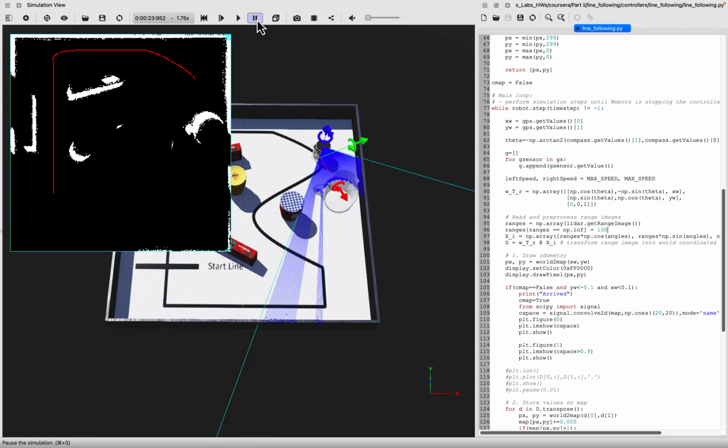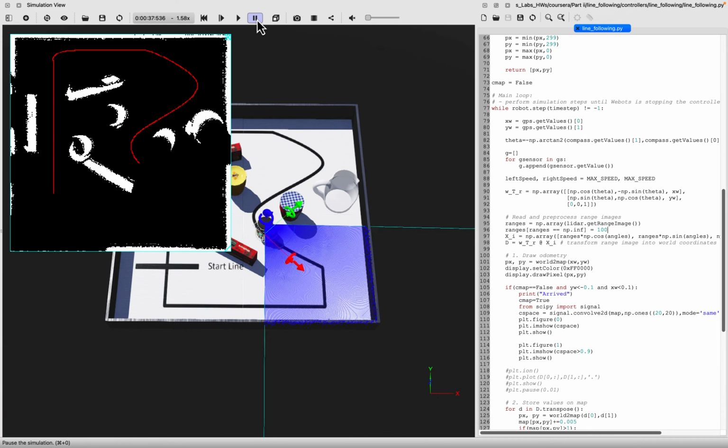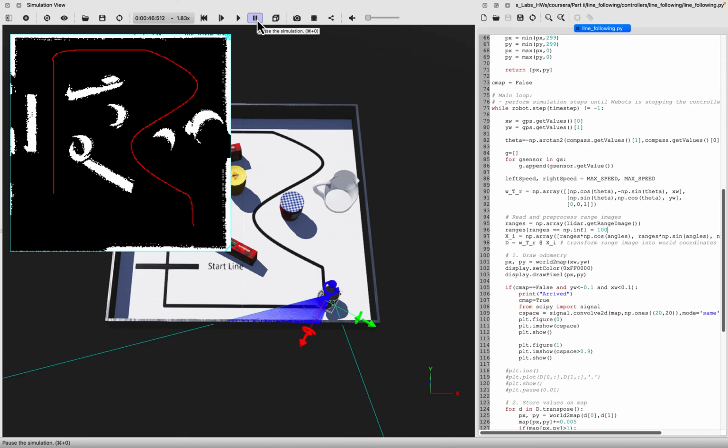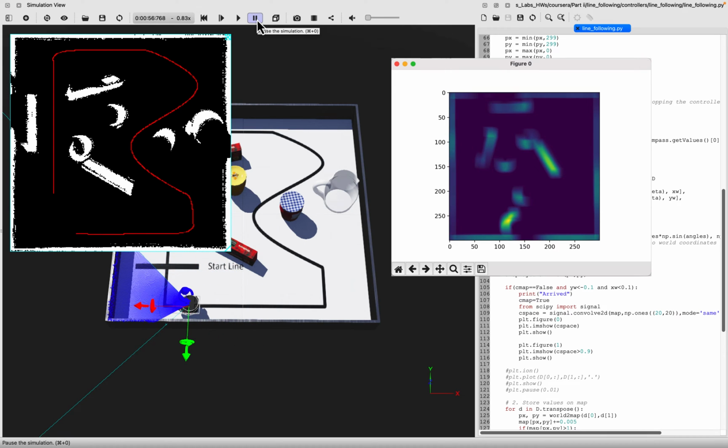And let's speed this up a little bit. What you can do is actually grow the obstacles by a certain amount, which will make the remaining space 100% navigable for the robot. And this is best understood with an example. Now the robot created this map here, and now we do see a version of the configuration space, which is essentially this map that the robot has constructed, and every pixel in it is grown by what is called a kernel of size 20 in this case.